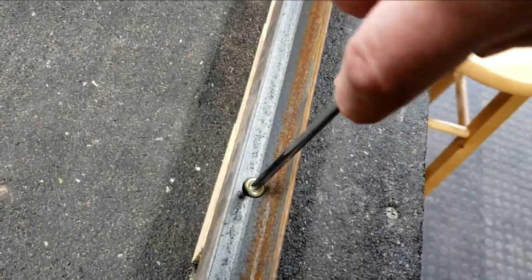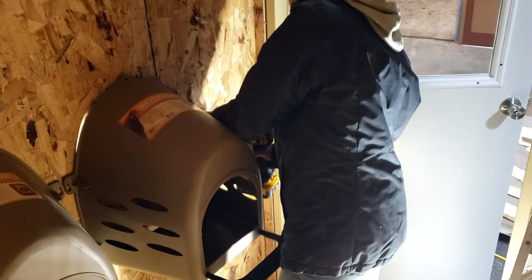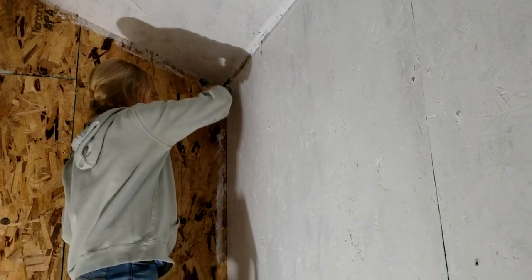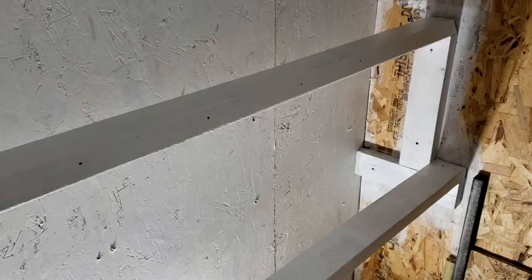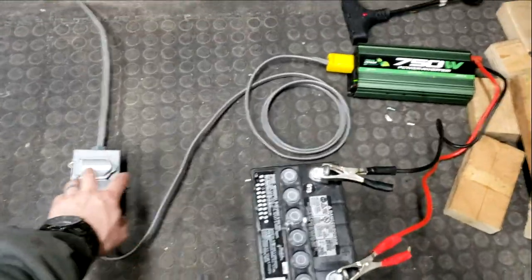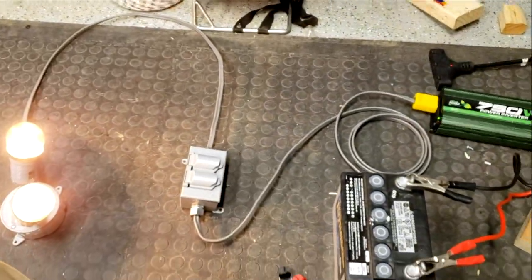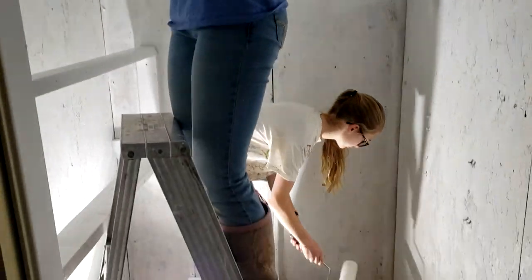This is the inside before it gets whitewashed — here's a shot of the door. The track for the chicken door is just two pieces of steel on green-treated wood. We put a shelf up there for the solar system. We had one nesting box and bought a couple more at Fleet Farm. We whitewashed everything with the watertight hydraulic basement paint rated to repel 10 psi of water. Then we did a proof of concept with our lighting — a light and a switch hooked to the inverter hooked to the battery, just to make sure it lights up, and the solar panel will charge the battery.